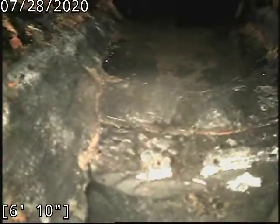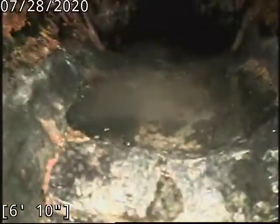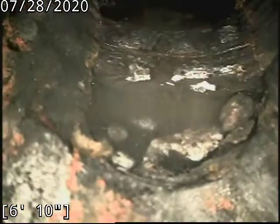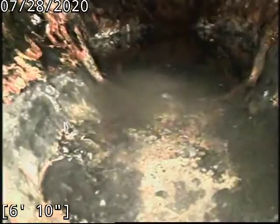So that's the outside of another pipe right there. The bell, the inside fitting is gone. But then the whole bottom in this next section is not there. It just disintegrates? It basically did the same thing as right here, where you can see it's rusting away in the gravel under the floor. Just keeps rusting and rusting and rusting.